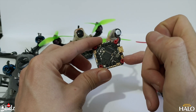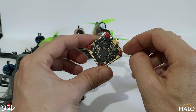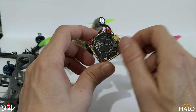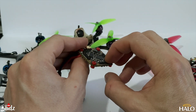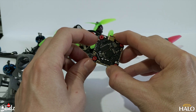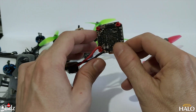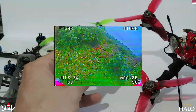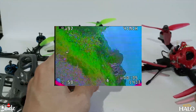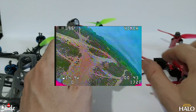Another thing I like about this board is that it has the option for plugs or direct solder on your motors. I personally just direct solder, but the plugs are actually really nice, especially if you're a beginner — if you break a motor it just makes swapping motors a bit easier with less soldering involved. The pads are very small apart from the LiPo pads, so you've got to be pretty good at soldering to do a clean job. But I ran it on this little four-inch with absolutely no problem — full throttle loads, really pushed it as fast as I could make it go, though the KV is a little low for 4S.